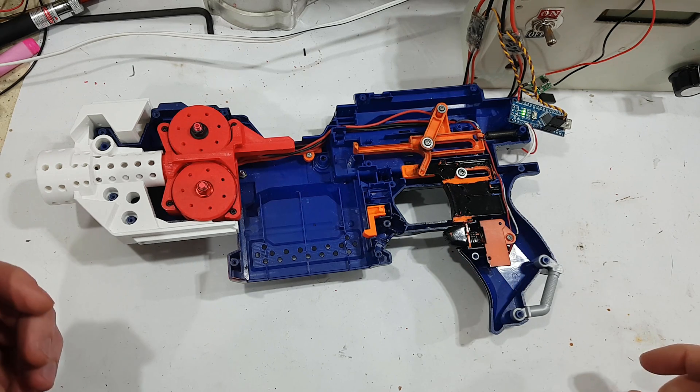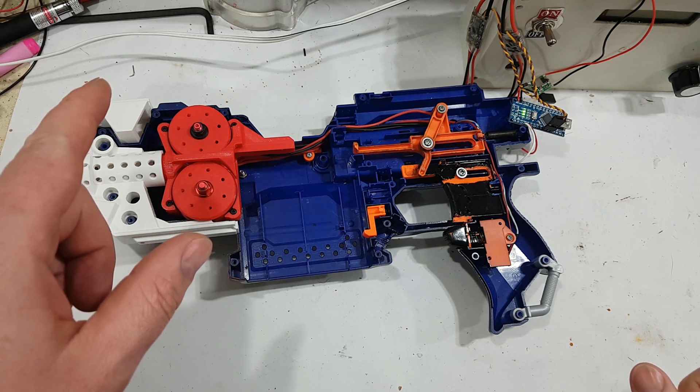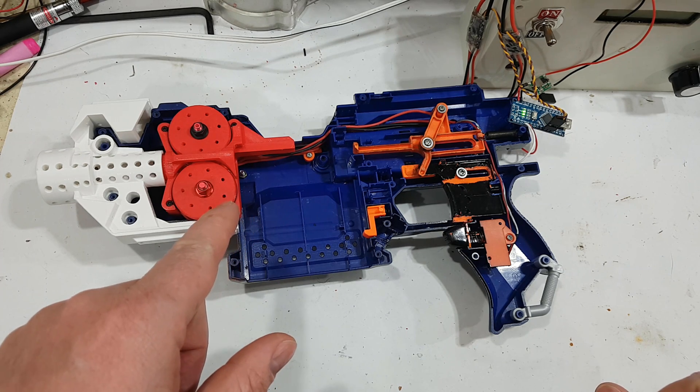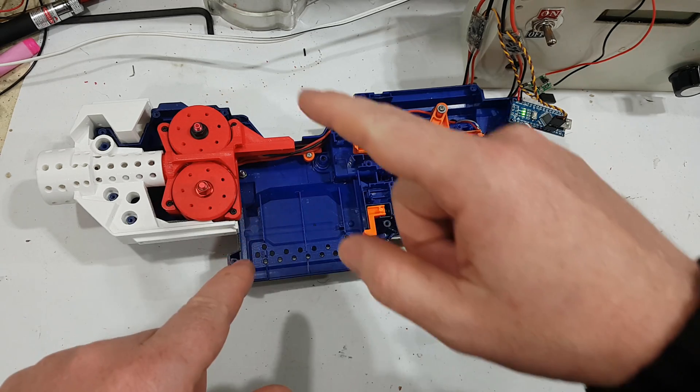You can tell that it's non-linear, and I've intentionally made it non-linear. I've made it go from 100% full RPM down to 33% in 2.5 seconds, and then a total time of four seconds down to zero, which is non-linear.